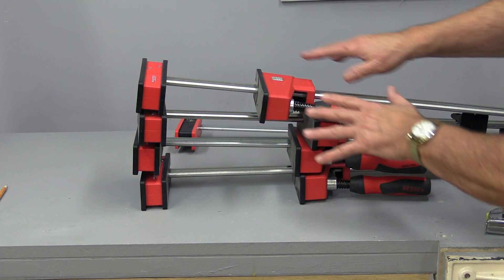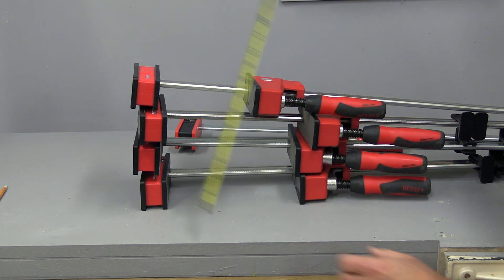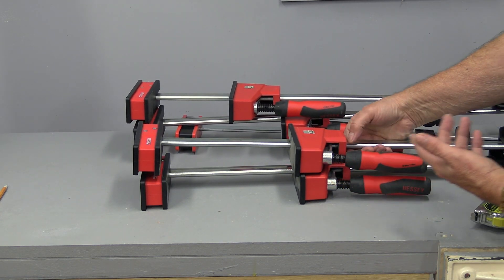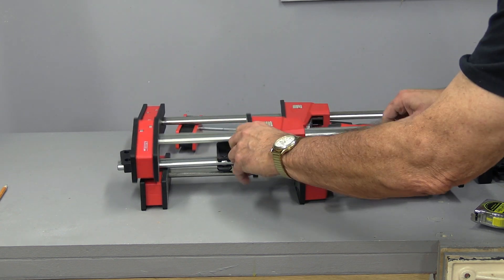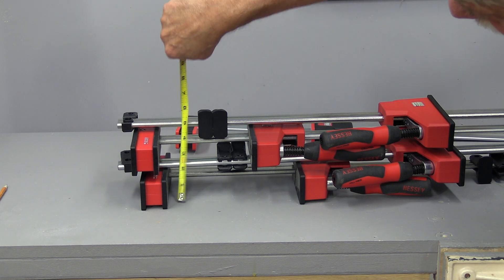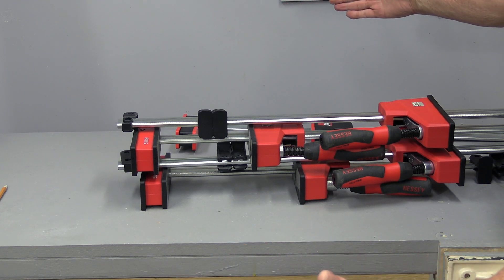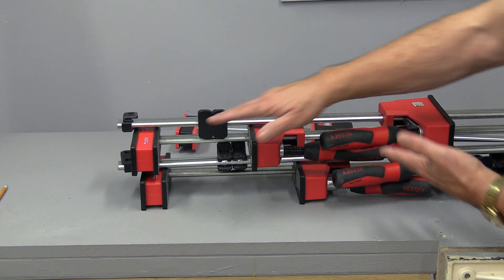The problem is they don't really fit on the original rack I made a long time ago. I only have four of these original K-body versions, but they're really heavy and take up a lot of room. When I stack them up like that, they take over nine inches. But when I was designing this and looking at what I could do, I decided to try this — look at what happens when you flip these around end for end. They stack pretty easy, and instead of taking up nine inches, it only takes up five inches. So I could get almost twice as many clamps on the same size rack, which means I can make it quite a bit narrower. That's precisely what I'm going to do — flip them rather than stacking them all side by side.